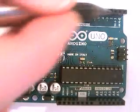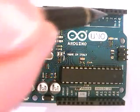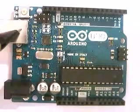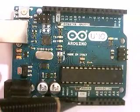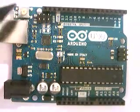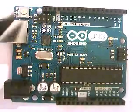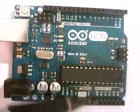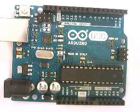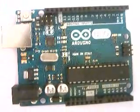Final review: on the digital side you have PWM outputs or digital in and outs, and TX/RX as replacements for USB. On the power header side you have voltage outputs at two levels, a reset pin, grounds, and VIN to power the Arduino without USB or the barrel jack. And you have analog in pins which are only for reading resistance or analog values. That's basically the Arduino pinout in a nutshell.